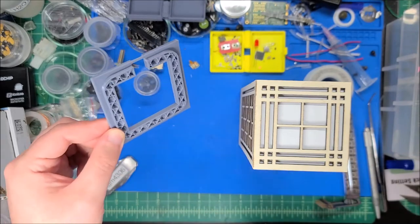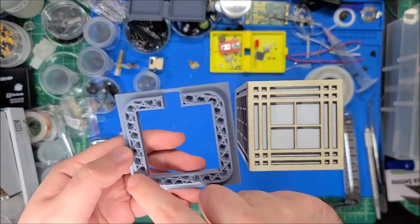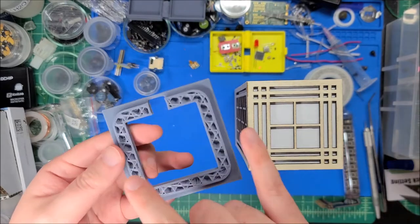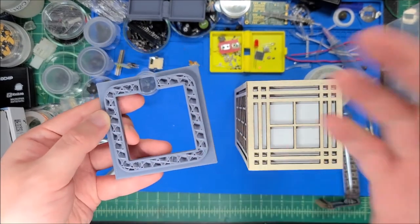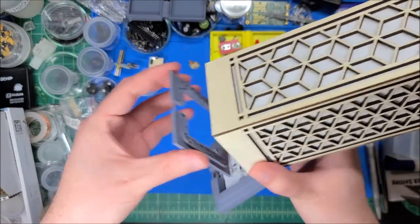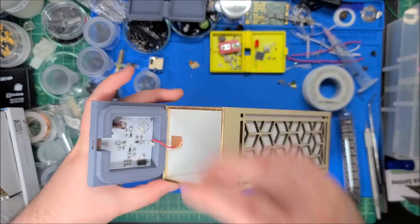That's a really good tip, but I still got the tolerances wrong — this part came out too loose. When designing clearance between parts I added an offset but forgot it offsets both sides, so 0.5mm became 1mm total clearance. I ended up setting it to 0.25mm offset so the total is 0.5mm all around, which worked well. You can also see how I accomplished the touch sensor: I cut a piece of copper tape from my scrap box, soldered a wire to it, and taped it on the back of where the power symbol was engraved.